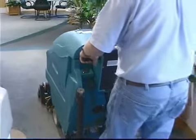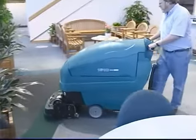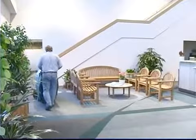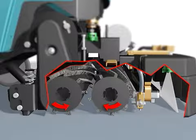Restorative extraction: you should use restorative extraction periodically to thoroughly clean to the base of the carpet. The amount and type of daily traffic are important factors to determine how often it should be performed. This cleaning should be planned in advance and performed during closed hours; allowable drying time is 4 to 8 hours. When using restorative extraction, hot water and cleaning detergent are sprayed onto the carpet as two counter-rotating V-pattern brushes agitate the solution deep into the carpet, and the vacuum shoe recovers the dirty solution.